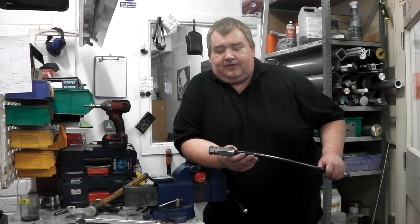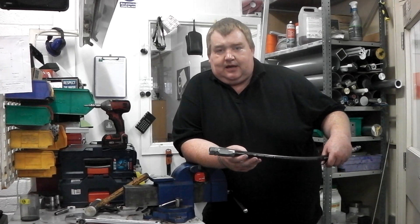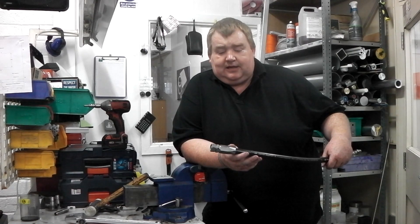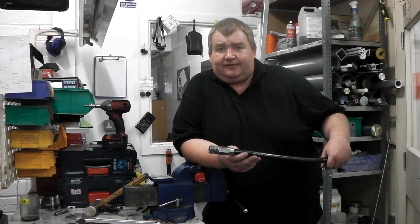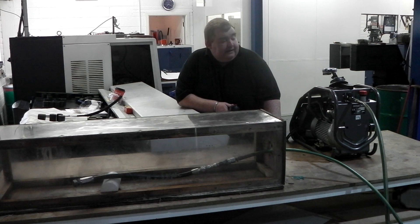As you can see now, we have a coupling on a half-inch hydraulic hose, and we'll show now what pressures we can take it at — you will see that it will not come off. I'm about to demonstrate the king coupling here now. You can see the pressures on the gauge as well. I'm going to go up to about 9,000 PSI — it's a constant pumping machine and I'm going to have constant pumping for a few minutes — and you're going to see that the king coupling is fine.